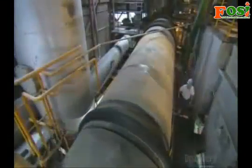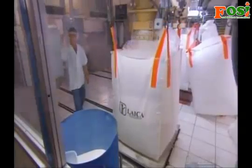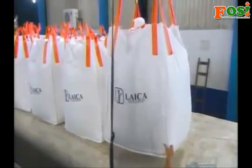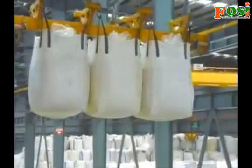The sugar on the conveyor now goes into a large dryer. Hot air blows into this dryer to bring the sugar's humidity level down to 0.02% — the standard for table sugar. The dried sugar pours out of the dryer into a bag on a scale, which is full when it weighs in at 1,000 kilos. A hoist then carries the bags to a platform at the far end of the packing facility — at 3,000 kilos, that's a heavy load.